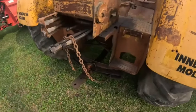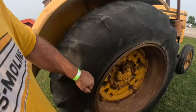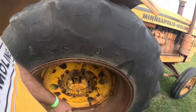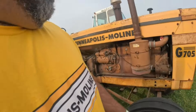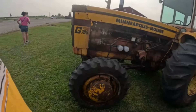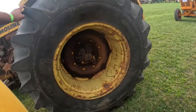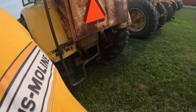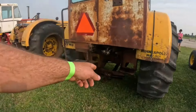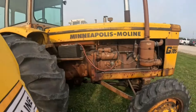Guy's with Minneapolis Moline — I'm just videoing these here. Got an interesting drawbar roller on there — I've never seen that style, usually it's two. No batteries on her, probably just pull-started it. 705 with four-wheel drive and a cab. Coleman front underneath this one. Big meats — 23.1-30 on there. Very nice. That's the drawbar roller I was talking about.